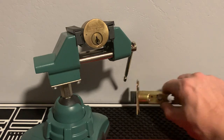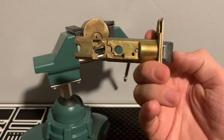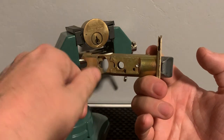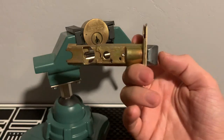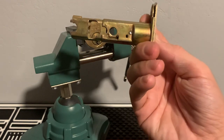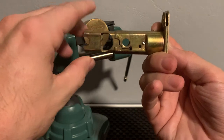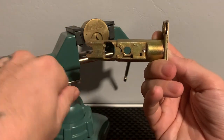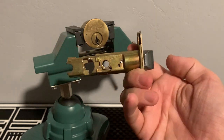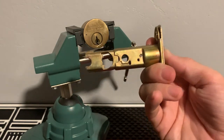We'll start with the latch situation. There are a couple of problems people run into with latches. One I notice happens a lot when people install a brand new doorknob is they over-tighten the screws as they mount the knob to the door. When you twist the knob to try it and let go, the latch just kind of doesn't pop back out. If this is happening, back the mounting screws out half a turn each, then try and twist the knob and see if it pops out. If it still doesn't, loosen it up another half a turn.